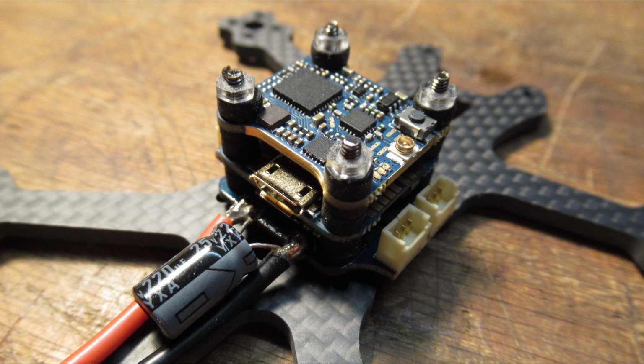You're going to have to go into Betaflight Configurator and change the yaw setting, either 90 degrees or 270, depending on how you have things set up, if you're going to have that USB connector come either off the front or the back. Once you do that, you should be set to go. I double-checked the motor resources after I made that change, and everything seemed to go well.